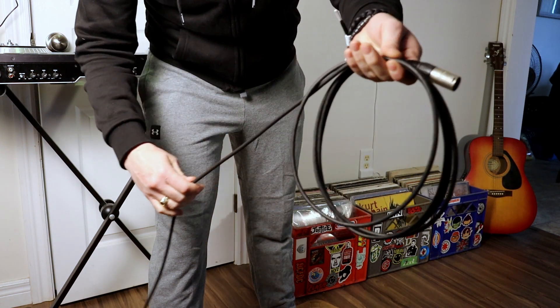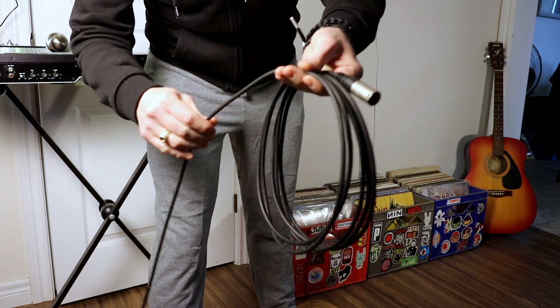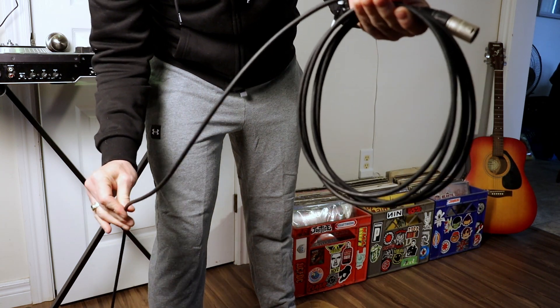Coiling a long cable in a figure eight is the equivalent of over-under. To clean up a badly trained cable, coil it neatly and heat it with a hair dryer or throw it in the hot sun for a little bit to soften it up.